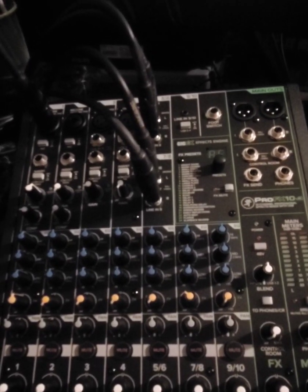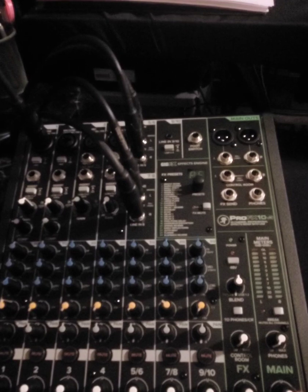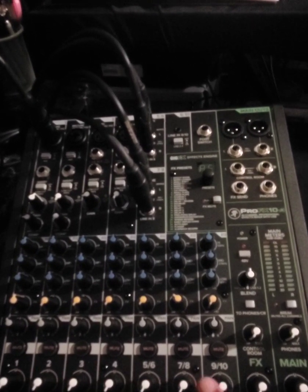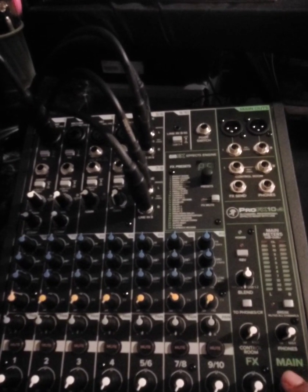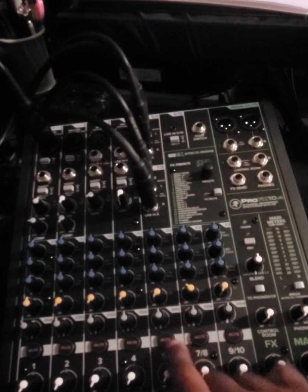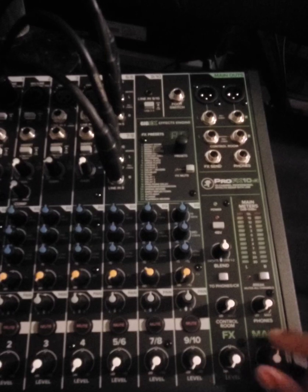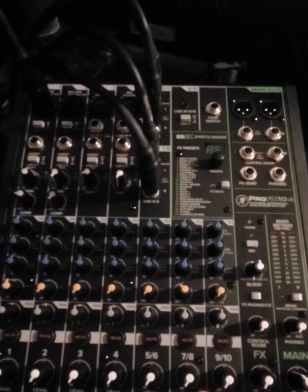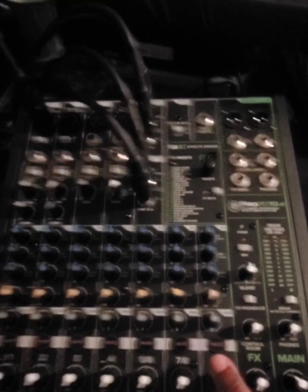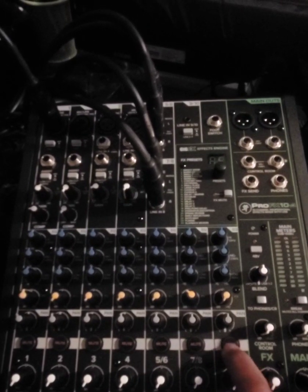It has so much on it, but yet it's simple. This is the main volume control, and when you're using it you have to remember that when you're online, the main volume control will not turn off all of your channels. So when you want to turn everybody off who is online using this board, you have to press the mute buttons. Mute buttons are on every channel. The main volume button will not turn off all of the volumes — people will still be able to hear you online. So whenever you're online and want to mute any channel, make sure you press the mute button.